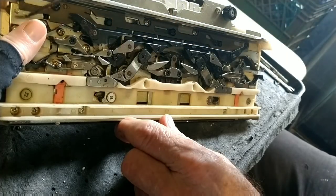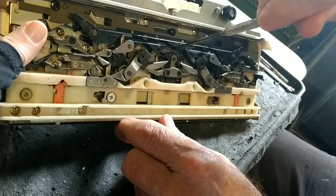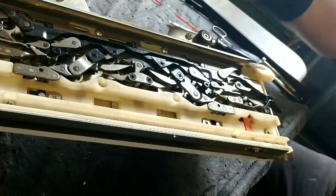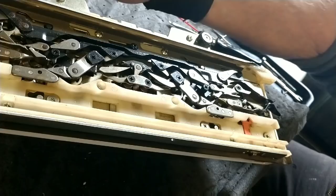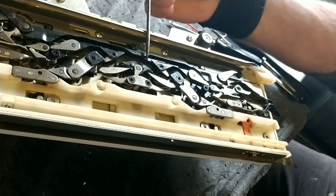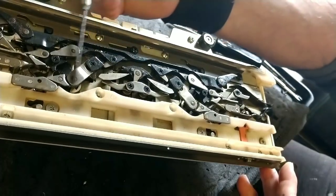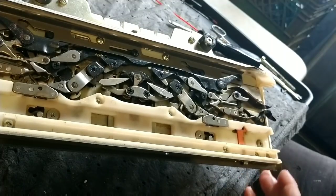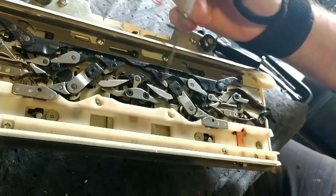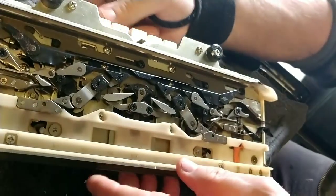Do it one more time. We're coming through and now it's starting — that center slides over and then you see when it gets there. Now push the slide to and fro. This is the center — we can see it better. The needle butt is traveling through, you notice it catches the tip of it, pushes it, and then that defines the path right here on this side for the needle butt. Feeder one is working okay and those stitches are knitting. It's dropping or failing to catch the yarn that's in feeder two, so we're suspecting this is the feeder two section. You see it's got to come down this way and out again. Let's engage and disengage MC and let people watch that path get created.